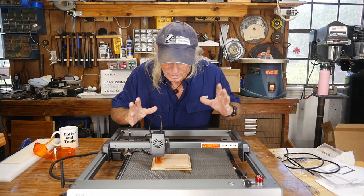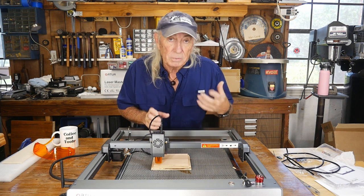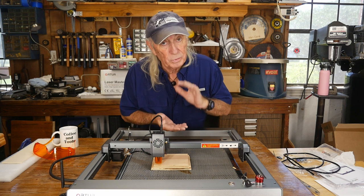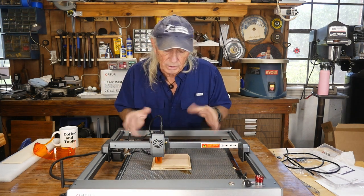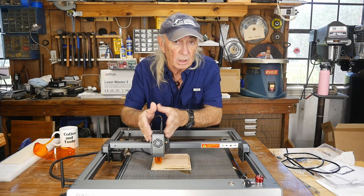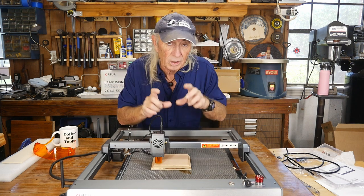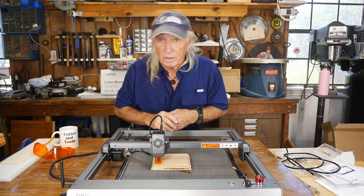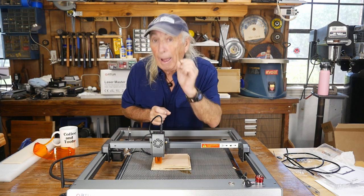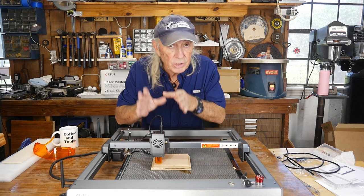Here's the deal: I'm going to cut layers of plywood. I've cut out some little squares of quarter-inch plywood, which when I actually measured it was 3/16ths — welcome to America. I cut four pieces so I could get three-quarters of an inch thick, which measures a little over 19mm. This is supposed to cut 8mm, so without adjusting the laser head — someone asked about depth of cut before — you can lower the laser down a bit and make another pass. Anyone who uses these will tell you you'll end up with a lot of charcoal, but you can cut down through as long as you can move that focal point, which is where the laser hits hottest.